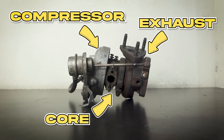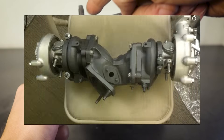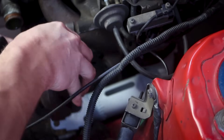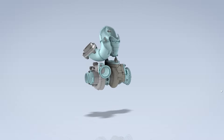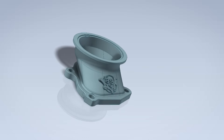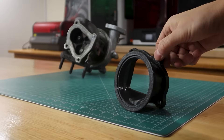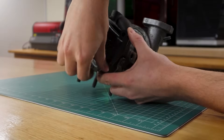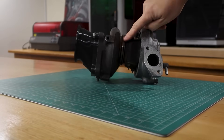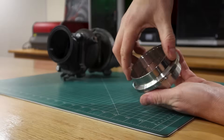I mentioned previously that the CT12A is one of the factory twin turbos of a 1JZ, and that they actually are mounted in such a way that they share a dump pipe. Obviously, I'm only using one of them, and I'm going to need my exhaust to run down here. I'm pretty sure there's no real off-the-shelf solution for this, because who uses a CT12 anyway? As such, I've designed my own solution — I actually designed this back in 2020, and I've now got a sponsor on board who's going to help me bring this to reality. It's looking like it's going to have pretty decent flow out of there. I also incorporated a V-band attachment, which is a relatively common form of attachment particularly for exhaust couplings, and it's also what joins the core and the rear housing of the turbo. So I'll fit up the remaining V-band components and let's see how it looks on the car.